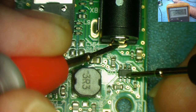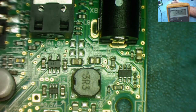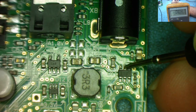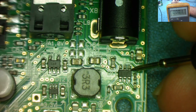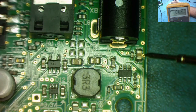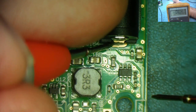So does any other pin on this chip go to ground? If so, this possibly could have a short circuit. Yes. That pin goes to ground. So that's a possible path to ground. Is there anything else that could be short on this? Let's have a look, where does the 12 volts go?